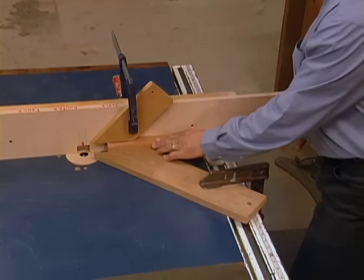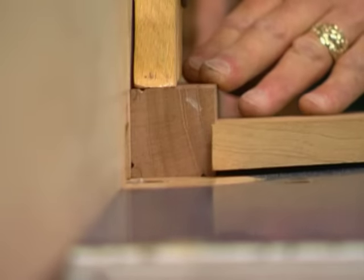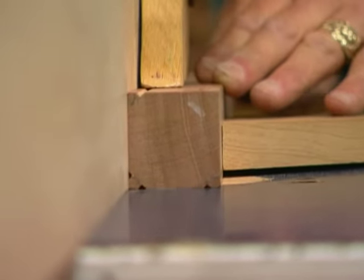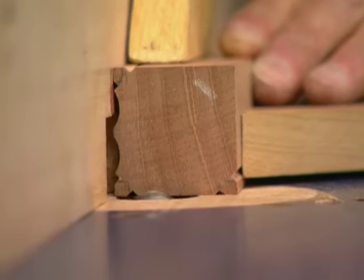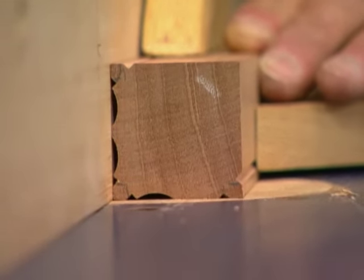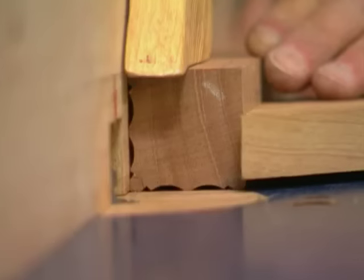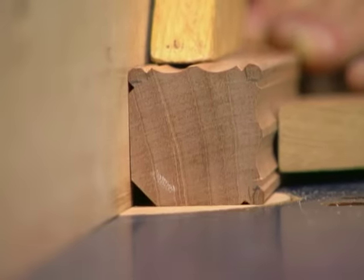It's the combination of passes that gives our legs a classic shape. The V-bit cuts the lines that define the edges of the leg. Two concave cuts are added to each of the outside faces with a core box bit. The radius bit softens the outside edges adjacent to the V cuts. Only one pass with a bevel bit is needed on the inside corner.